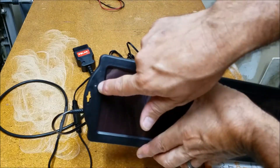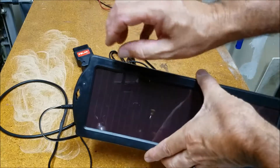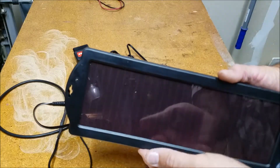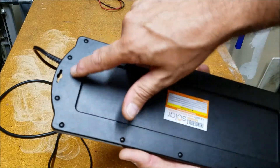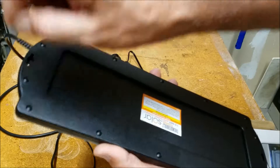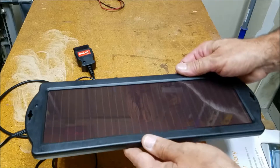One thing I'm going to do is disable this light. I have another one of these I've already worked on for my travel trailer. This little LED lights up when it's charging — it flashes when it's low charge, steady when it's full charge or charging at full voltage. And it just takes voltage away, and this is a very low wattage charger, so disable it I will. You may see these little covers here need to be popped out with a small scribe. There are small Phillips screws in there and everything is covered with black silicone inside, so you have to dig around to get to the connections to cut and disable the light. But it does improve it a little bit, and my trailer and my truck both have pretty good batteries, so this ought to be enough to just keep them topped up.